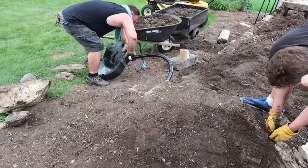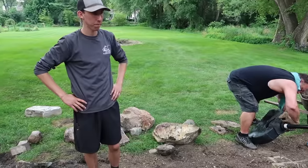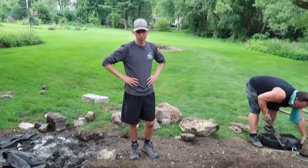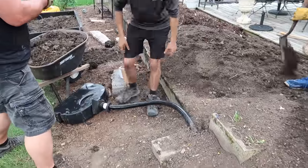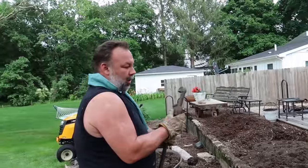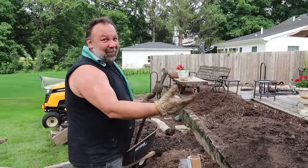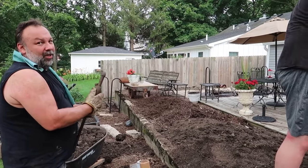We don't need the pavers under there. I think what we should do is just kind of reverse this — the basin's already set, but we need more soil in here. We'll get some of the soil and throw it over there. We want to have it about that height — just take those cinder blocks out, put the dirt in here, tamp it down, and then put the rocks in. One of the challenges was, Gary, you actually hooked this up before you put all the rocks in. Where we like to hook it up last so we can pull the liner back. It was set up as a volcano and it was all together when we had to lower it.